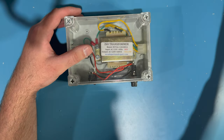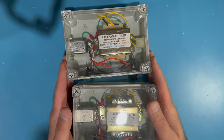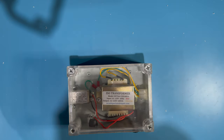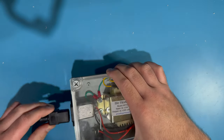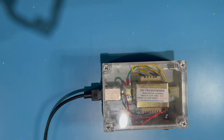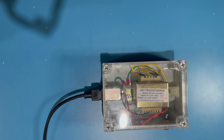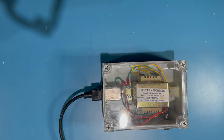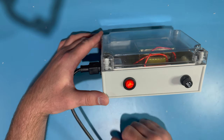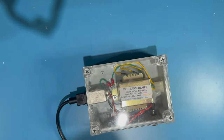We should be ready for final testing. Here is our second prototype unit — it looks just like the original, the same parts put together the same way, and hopefully it should work the same way. I'm going to take my IEC power cord, plug one end into the socket of the — calling it a monitor test bench isolation transformer power supply is a mouthful, but I don't know a better name. It's plugged in. Our first test: we turn the switch on and the light comes on. Nothing's on fire, I don't hear any crazy sounds.